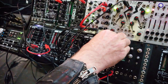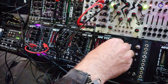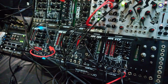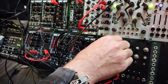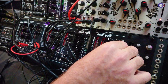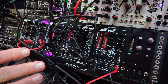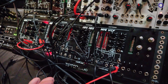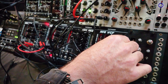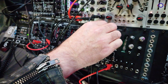The filter is interesting. Is that the resonance that we're hearing there? Right, that's the resonance in the filter. Each one of these — essentially the tubes in all of these can be overdriven. There's a phase control on the VCF. With the fact that we're using tubes in these, there's a lot of different possibilities that we break out to the front panel that you wouldn't necessarily find in a normal filter or oscillator or VCO, that allows you to alter the timbre quite a bit.